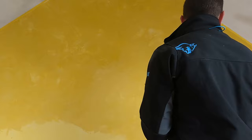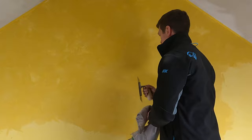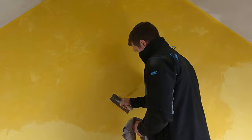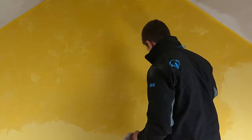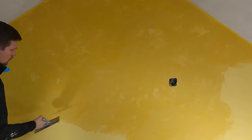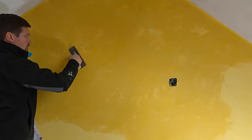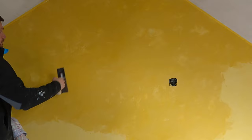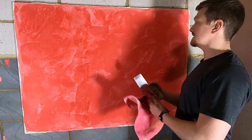Once you've applied a section, give it an initial polish — not hard, not a lot of pressure, just a soft trowel sweep. This is how fast it dries: it's not fully dry, but it's dry enough to polish. Give it a few sweeps, not too much pressure because the plaster can peel. Then come back on the section you did before — that one has had more time to dry so you can go harder on it, really burnish and polish it up without worrying about the plaster tearing. This is when you start to get the shine and the main characteristics coming through.